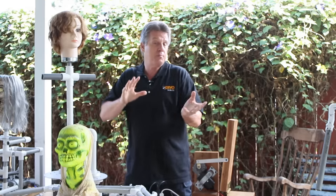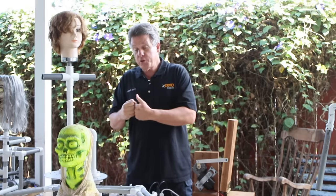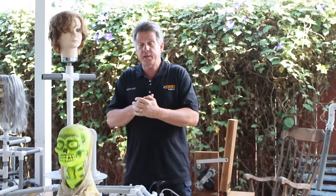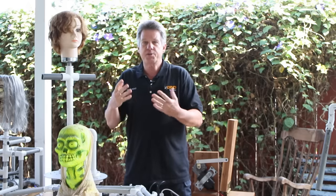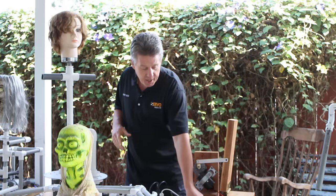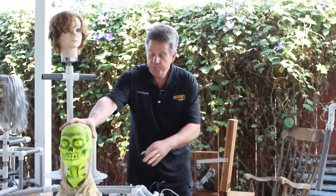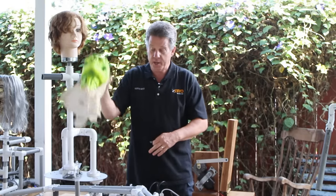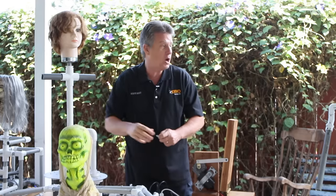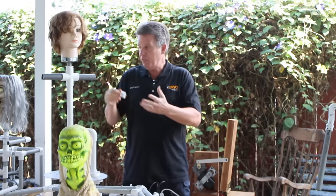If you really want a much tighter connection, you can ream out either the fitting or your piece of PVC so it rotates on that and have a much firmer connection. PVC is also easy to work with a heat gun — apply some heat and get some bends in them if you need to adjust them. Instead of using a hacksaw, a PVC cutter like this one will really make that job a whole lot easier.